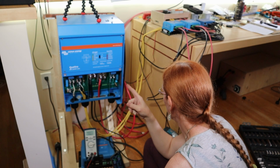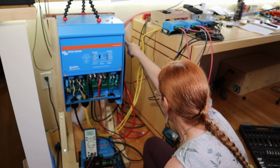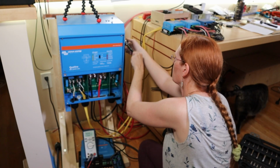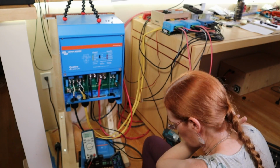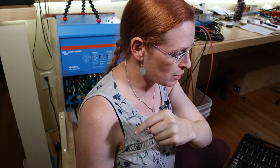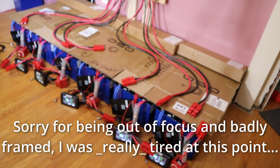I am going to connect the new battery directly to the bus, bypassing the SmartShunt, and see if I can start it. Hey, Tatters. All right, that now connects the other bus bars. I don't have a pre-charge resistor on. If I use that pre-charge resistor on the old battery, and then I turn this on, that should be high enough voltage, judging by how slowly it's dropping. So let's connect this. Actually, no, let me get the app first.